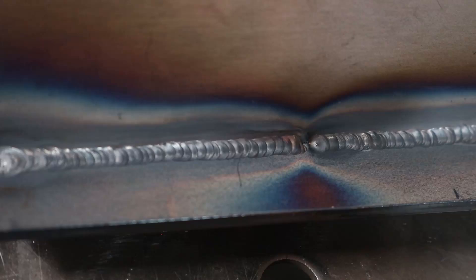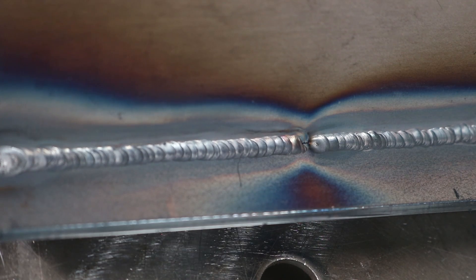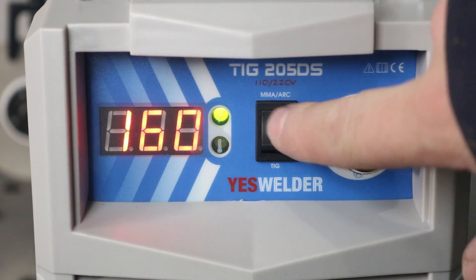So I'll go ahead and run this fillet here — it's running along pretty well. I had the filler in kind of the wrong spot there for a second, but we're back on track, still maintaining that 120 amps. Now on this one I'm going to stop in the middle of the coupon, reposition the camera and take a look. Now I'm going to take a pause and crank my amperage up from 120 to 160 amps just to see how this is at the higher end — and that's going to let me weld a little bit faster. When you turn it up like that, sometimes you reduce your overall heat that you put into your part because you're not camping out and letting that heat soak in; you're able to move a bit faster. So 120 amps there and 160 amps in the later part — you can see it's a little more consistent. Either way you can get about the same size fillet weld just by varying your speed.